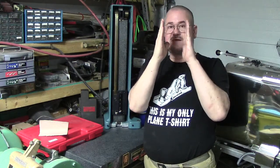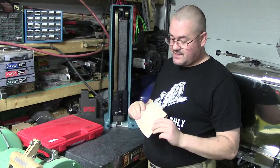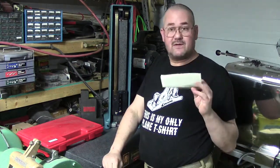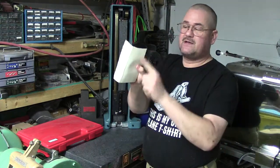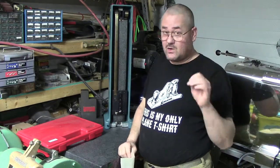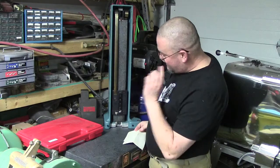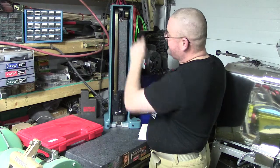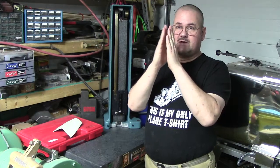So to keep it from sliding side to side, I put, and I have, old school military, I've got a bunch of this floating around being a medic, moleskin. I thought, okay, which I've got some over here on the bench. I was thinking little pieces of rubber. Oh, wait a minute. The reason I like the moleskin is you cut the little sizes you need with scissors, and you peel the adhesive off the back. So that's what I did, because I know that moleskin does not hold moisture. And we're not using any oils, so we don't have to worry about it. So I cut two small pieces, put one in behind this clamp here, and then I put a small piece you can see up there. And all that is to give it a little bit more of a clamping force, if you will.